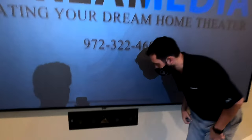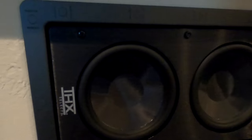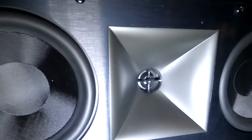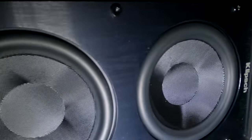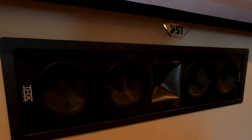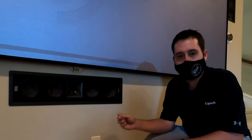Let's move into this one since it's closer. So what we're doing with this speaker specifically is we've got four five-and-a-quarters, and this is a fiberglass cone. One of the nice things about a fiberglass driver is it's lightweight but also rigid. The important thing about a lightweight but rigid cone, a lot like Klipsch, is you're going to get a lot of efficiency. Efficiency is important — we're able to get good sound at a low volume, and we're not going to need a lot of power from our amplifier. Being a lightweight cone, it's going to stop on a dime and it's going to have a lot of midrange.